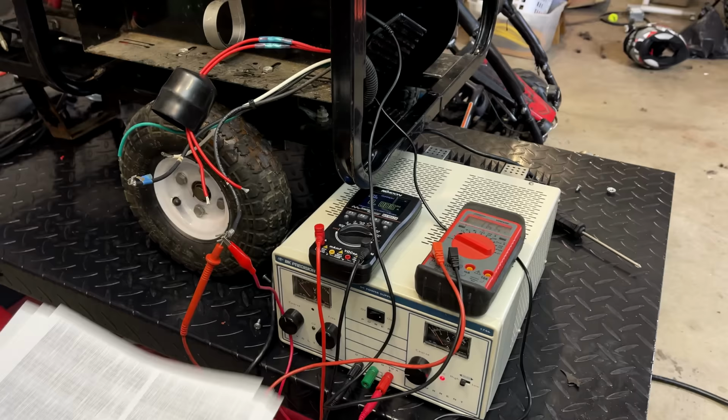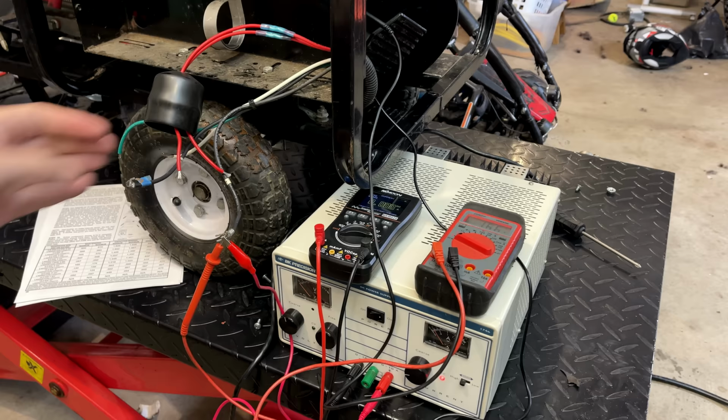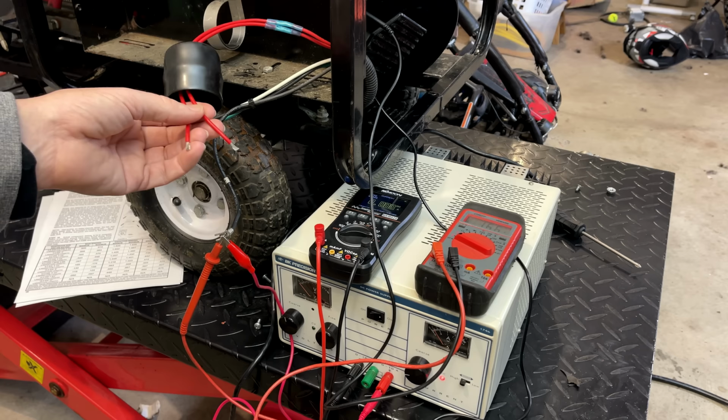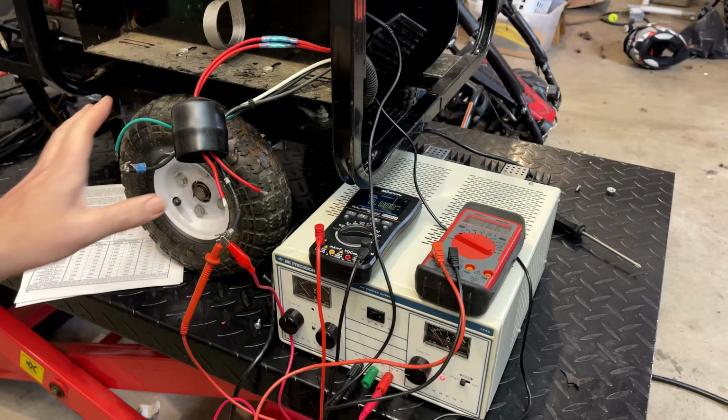You know, I do have another capacitor. It's not the 50 microfarad, it's 35. I'm tempted just to throw it in, just on the off chance I had a bad capacitor. Granted, the rating's wrong, so the generator will not get up to full power. But it would be interesting to see if it blows like the other one. So I'm going to pause it here. I'm going to reconnect the control panel. I'll put another capacitor in there, and we'll try it one more time.